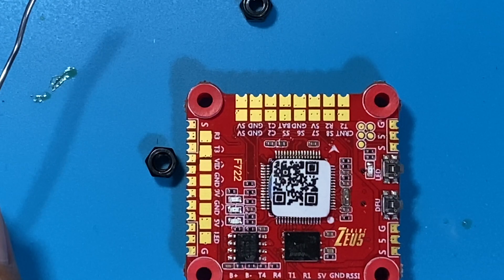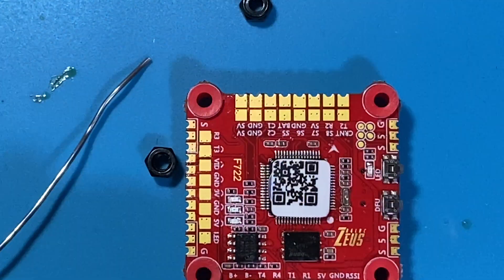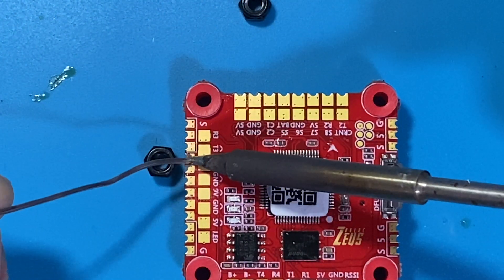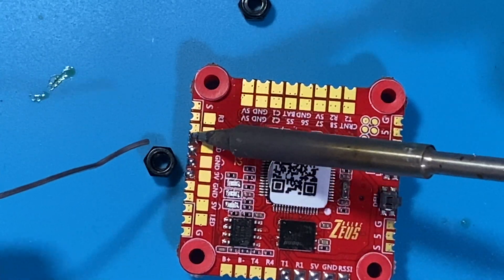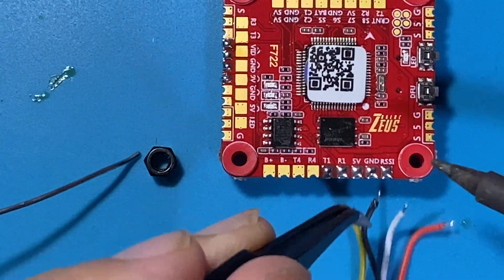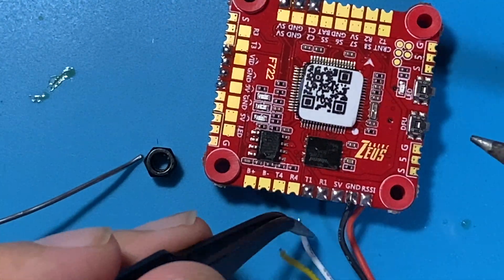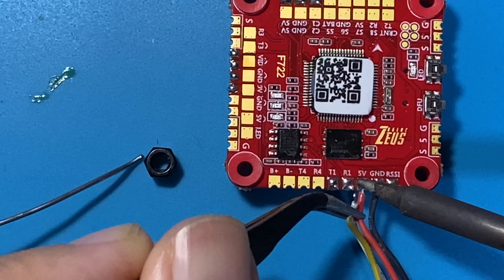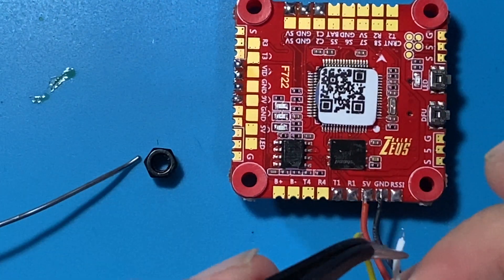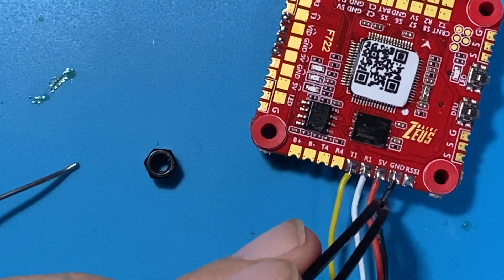Just making sure there's sufficient flux so the solder will take into the copper pad easily. That was the receiver pads, and now it's the camera pads. There's more flux. I'm going to do the VTX pads first — just double checking and making sure they're the correct ones along with the camera pads. The crossfire receiver is connected; just making sure everything is connected nicely. Making sure the solder is nice and shiny — when done it should be like one clean blob instead of wires sticking out.